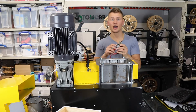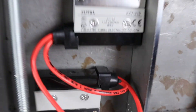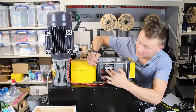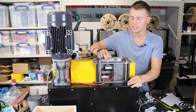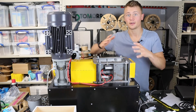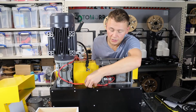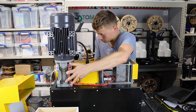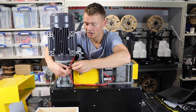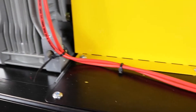Next are the pressure sensors, which come out the side of the electronics box. We attach those to the top and bottom of the shredder, secured with two M3 bolts each. These sensors check that the lid is on and that the shredder is properly attached to the base - essentially a safety feature. The instructions suggest using the holes in the gearbox to secure the wiring neatly with cable ties, which makes sense given the potential for plastic shreds and shards flying around.